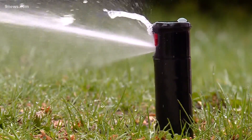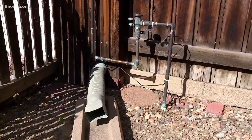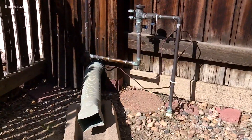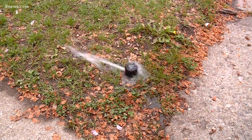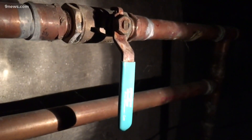The below-ground parts of the sprinkler system will likely be fine with the upcoming cold weather. The above-ground parts, like the backflow preventer, are most at risk when the mercury drops. The backflow preventer is the brass pipe that sticks out of the ground around the house. The owner of Colorado Sprinkler System says the key is to shut off the water to that pipe.